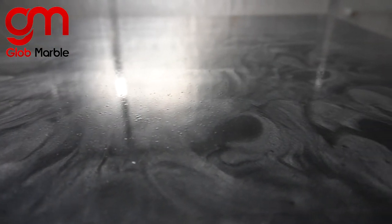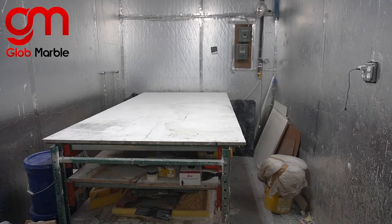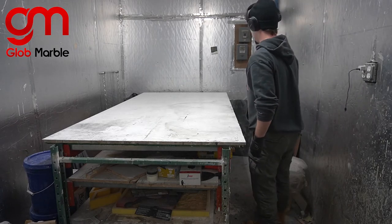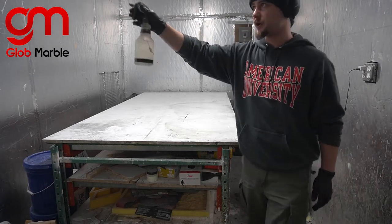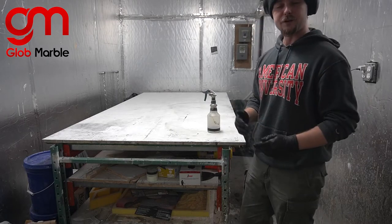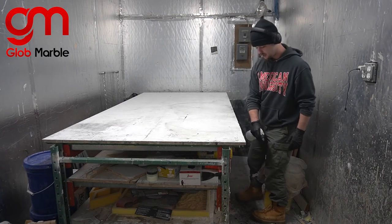Here's what ended up happening — this warehouse is so dusty. The manufacturer does recommend two coatings, so I'm going to sand this and take it home where it's way less dusty to do the second coat. If it really is not an option to work in a completely dust-free environment, here's something that can help: minimize the amount of dust you're going to be kicking up. Obviously apart from mopping and sweeping everything and making sure you're in a different room, something you can do is spray regular water on all of your walls, the ceiling, and the floor. This traps the dust — so when you're moving past it or brushing past a wall, your feet won't be kicking up as much dust as they usually do, and that's going to minimize the amount of dust that ends up on your surface.